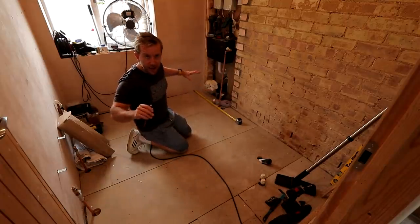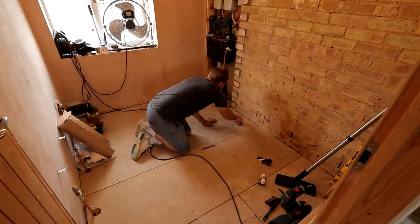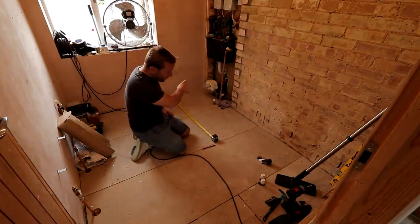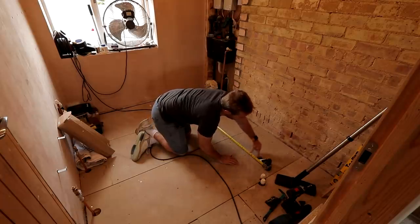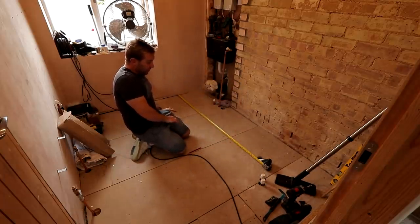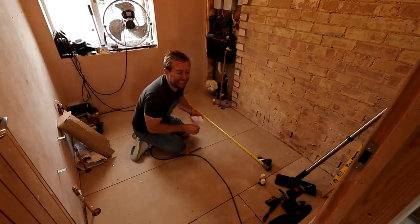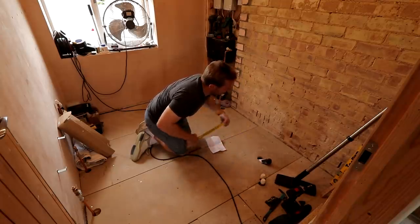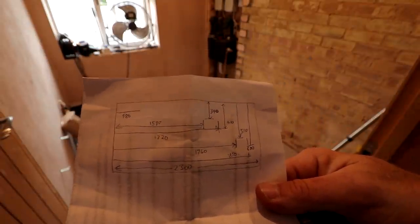Let's get on with getting this plywood down. I don't know how you guys do your measuring out, but how I do it — especially if I've got things like pipes coming out of the floor — is I use a tape measure and only measure off two edges: my short edge and my long edge. I'll measure out to where each pipe starts and write it down on a little bit of paper. By the way, I hit myself with a hammer — don't do that. Every time I put my hand in my pocket I'm like 'ow!' I'll take that measurement, then the other end, then come back and do the same the other way. In the end we end up with something that looks like a little box.